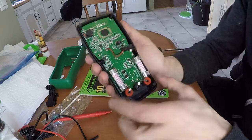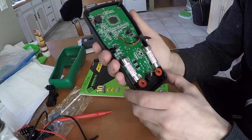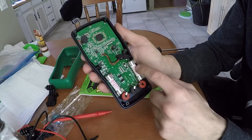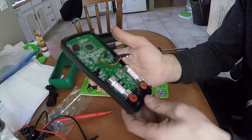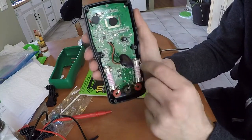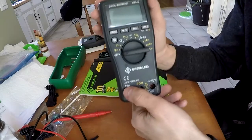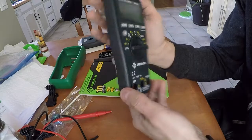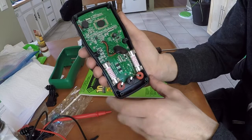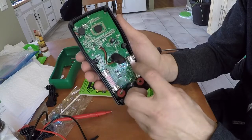On first look inside, we see it's got two large fuses — this one is 10 amps and this one is 400 milliamps. I believe the reason they're so large, even though the ratings aren't very high, is because this is a CAT 3 tool. The reason these fuses are so large is basically to protect the user. So if you make an error and run 100 or 50 amps through this, it's going to blow that fuse to protect the user.